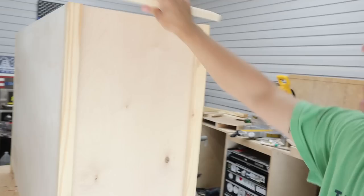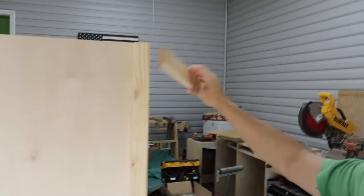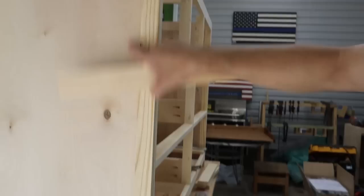I want to dress up the ends of this dresser. I don't want it to just be plain with the top on it like that. I think it needs a little something more. So I'm going to go ahead and put two pieces up here. One here, they're both 2 inches to match this 2-inch piece. So it'll carry that look on around, it should inset in there flush. And then one on the bottom. And then we'll put some cove molding on the inside of that, and it'll dress it up, make it look a little nicer than just the plain edge there. Like I said, these are 15 inches, and I'm just gonna glue and brad nail those into place, and then we'll work on the cove molding.